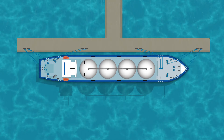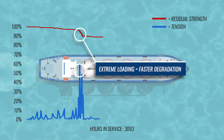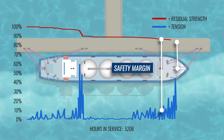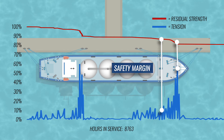Higher strand twist levels might not increase the rope's initial strength, but will reduce the stress on the fibers during cyclic loading, thereby increasing its life, all things being equal. When your lines are exposed to higher than expected peak loads from a storm or unplanned conditions, the lines may experience accelerated fatigue. These events can reduce the remaining safety margin of your system by degrading the rope's condition more rapidly than anticipated, compared to normal loading conditions.